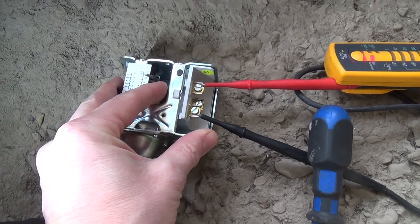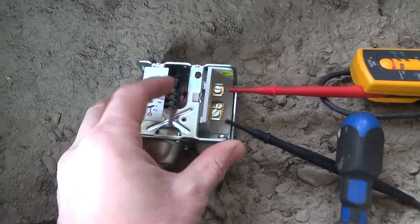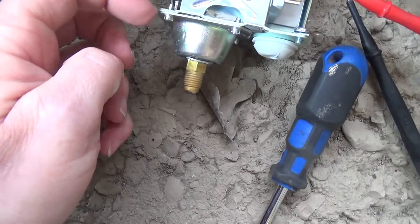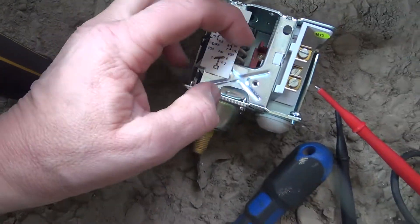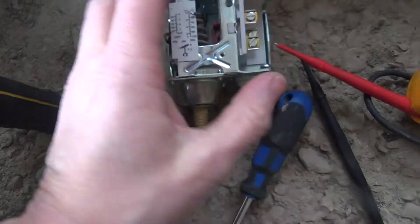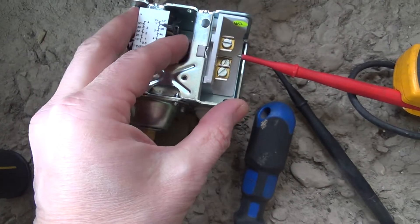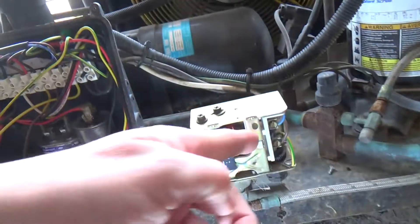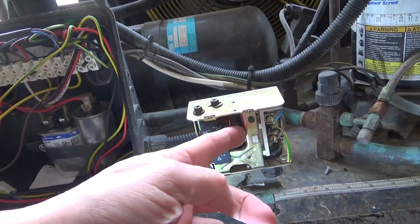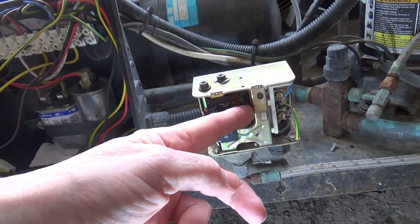Okay, that should be made. So as the pressure comes up in the bellows, it pushes that little lever up here, pushes that arm over and makes contact. Well, this one is already pushed over as far as it should go.